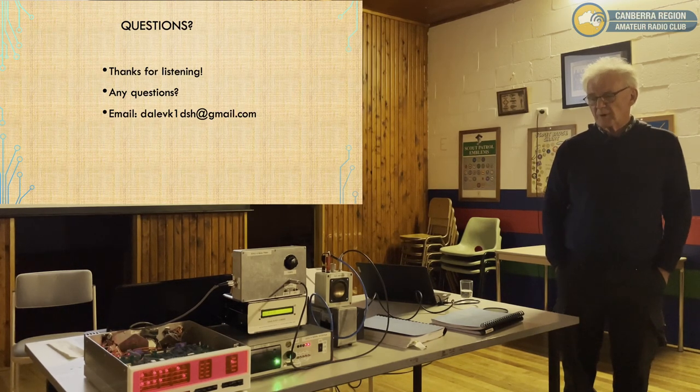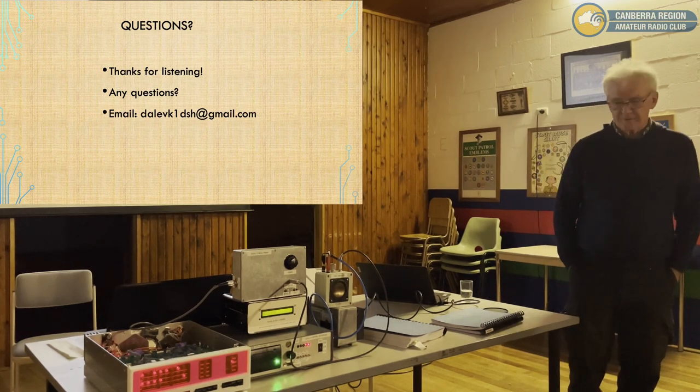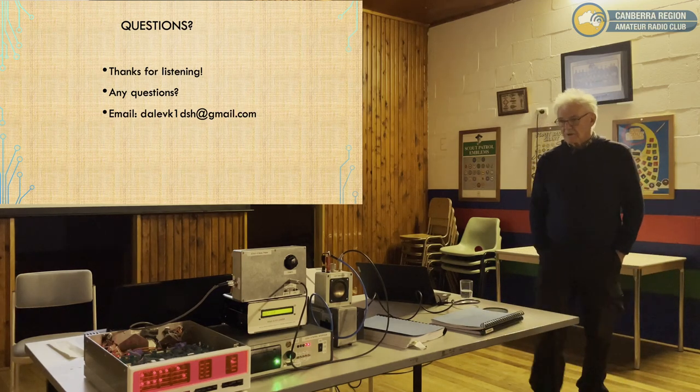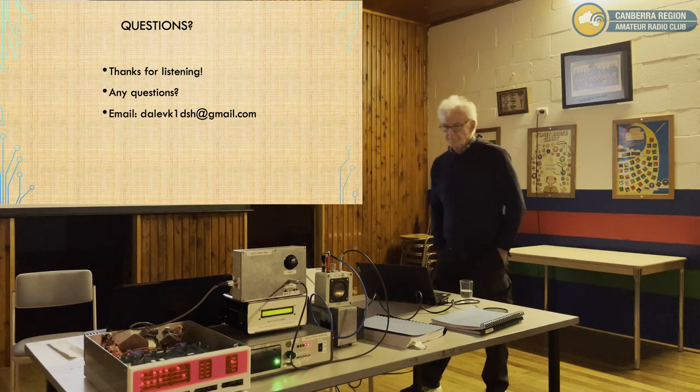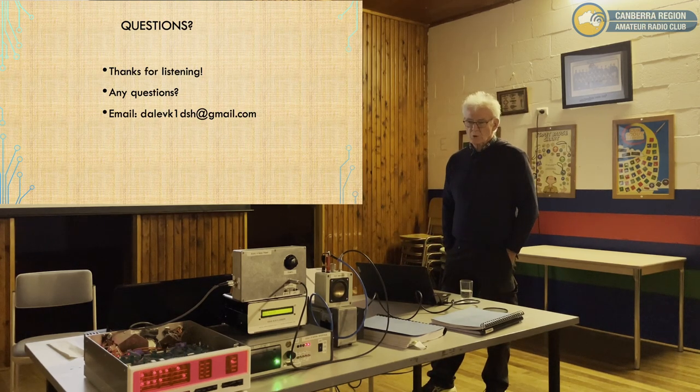Well, probably more for RAM. Maybe RAM's different. What are they? Is it two 1102s in that? No, 1101. 1101s, wow. Yeah. So there was a lot. When this machine first came out, it was actually a 32-byte machine. And then you realise that the price of memory chips came down, so it was quickly revised. So you've actually got 1101s in there? I've got 1103s in there.